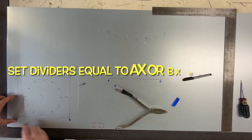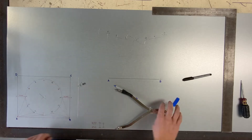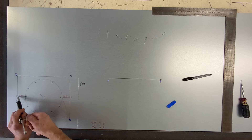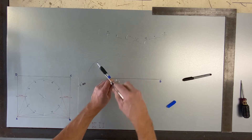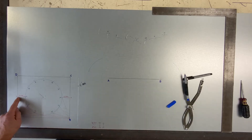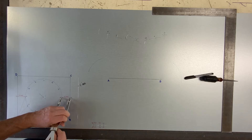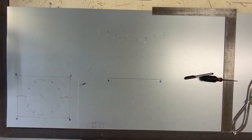Now that A4 and B10 are done, we need to find the length of the seam. From A to X is halfway from A to D, and A to D is 8 inches, therefore AX is 4 inches. Set your dividers to 4 inches and strike your arc on B with the same arc of 4 inches. Now we need to triangulate the seam — this length will be added to your true length triangle and then triangulated over 7.5 inches tall.